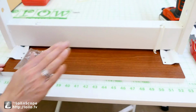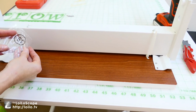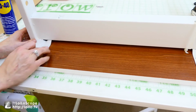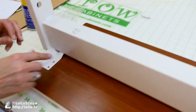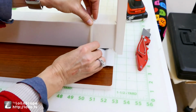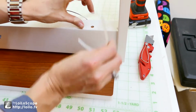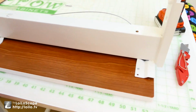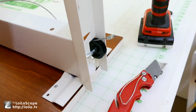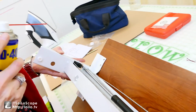So on each panel, there are 2. On step 8, you're going to grab your A3 platform, your airlift, and your bag of S1 screws, and you're going to screw down your airlift to your platform on the bottom, and there's some pre-drilled holes. So screw those down. There's 2 screws on each side. Then you're going to cut the zip strip that's around the airlift. Leave the wood block in there. It's really important to leave that in there, but cut this and remove it. And with some WD-40, we do recommend that you spray down your white glides here, as well as any of the mechanisms on the inside of the lift.